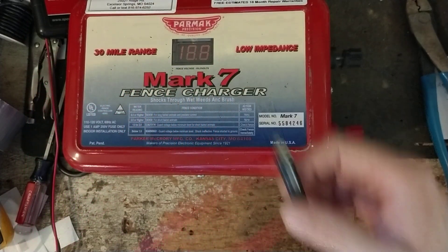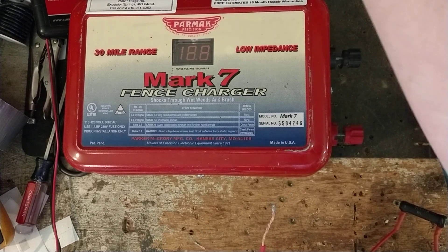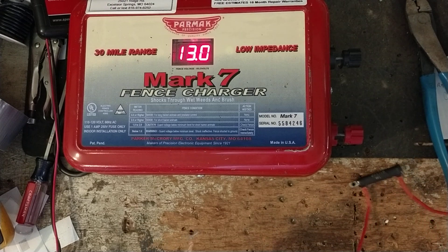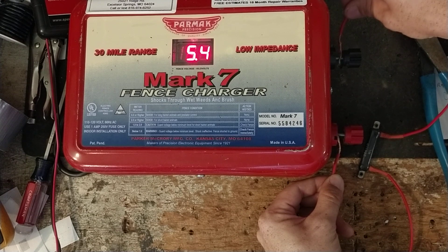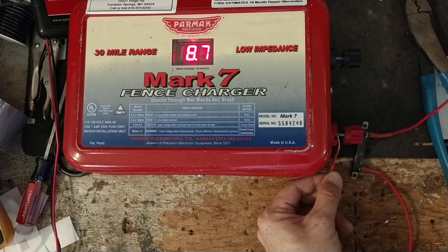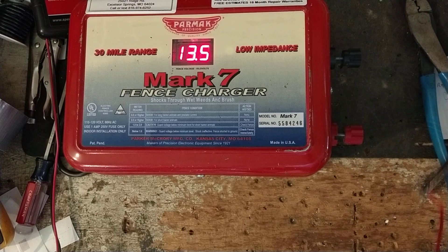So I've got a big resistor here — this is a 150 ohm resistor. We're going to put this across there. The closer you get to zero ohms, which is a dead short, the worse the short. So this is going to drag it down pretty hard. So you're walking by one day, it's reading 13,000 — you're like, all right, it's going good. You walk by a week later, now you're reading five, five and a half — this is reading five. So you turn the unit off, unhook your fence and ground, plug it back in and it jumps back up to 13 or 12 or whatever it's supposed to read. Then you know your charger's fine and you've got a problem with the fence.